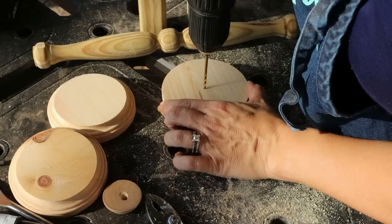The joints will probably need a little sanding but that's okay before we glue. Add wood glue in the holes — if a little gets through it helps strengthen the joint. For a much tighter joint, use a clamp. After letting the frame dry overnight, remove the clamp and sand the frame for a nice smooth surface. Using a sander makes it much faster.